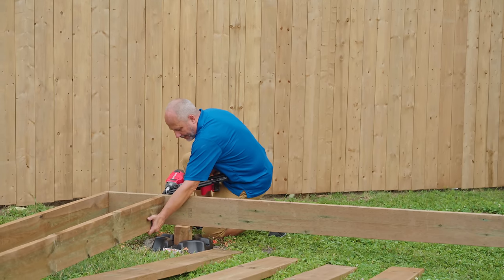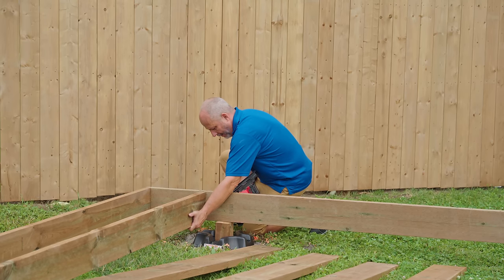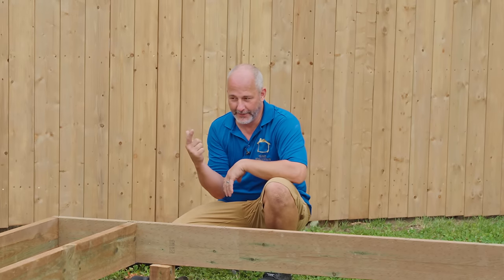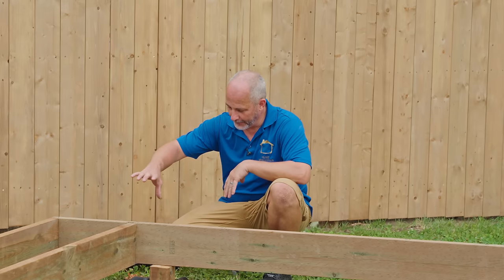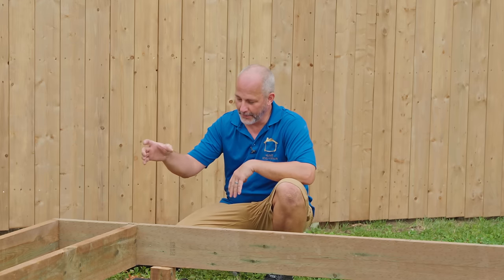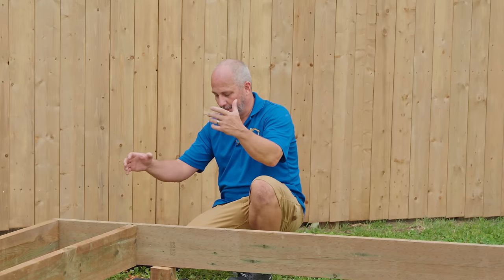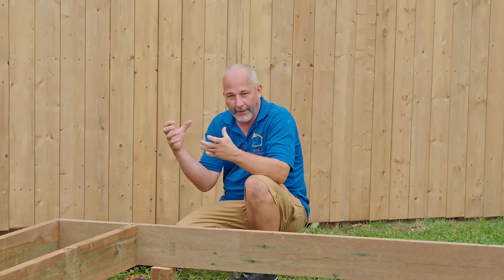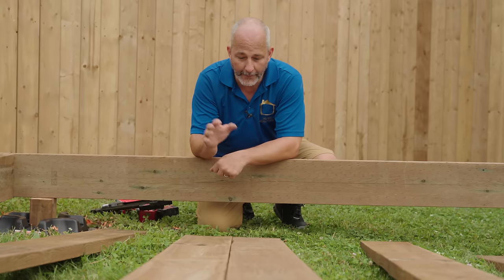What we're doing is just lining up our wood where the X's are on our frame. I'm going to use three nails and then a GRK structural screw as the fourth fastener. What it'll do is pull everything nice and tight, help maintain square, and eliminate the need when I put the joist hangers on to put a screw in every single hole — I just need to stick the hanger on and put a screw on each side to help transfer the load and take a lot of that weight off the nails and their shear strength.